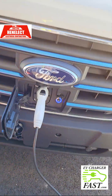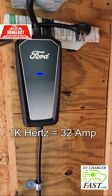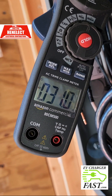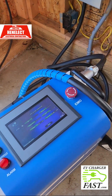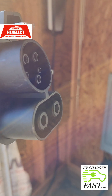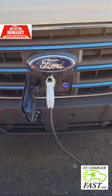The Level 2 has a 1,000 Hz CP signal, which tells the wall connector how much it can charge — that's 32 amps. So we are at just under 32 amps. Now let's take a look at what this 20-kilowatt DC fast charger can do. It has a 100-amp breaker versus the Level 2's 50-amp breaker. The CCS connector comes with it, but you need to have the DC fast charger connection on your vehicle for this to work; otherwise you'd just use the standard J1772.